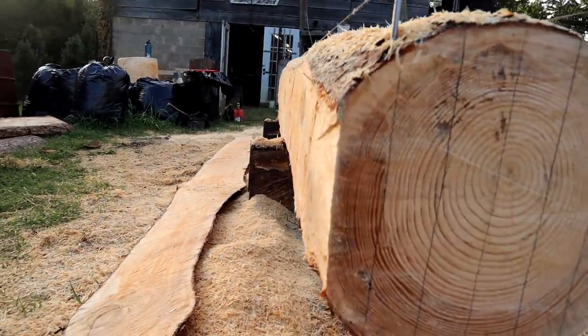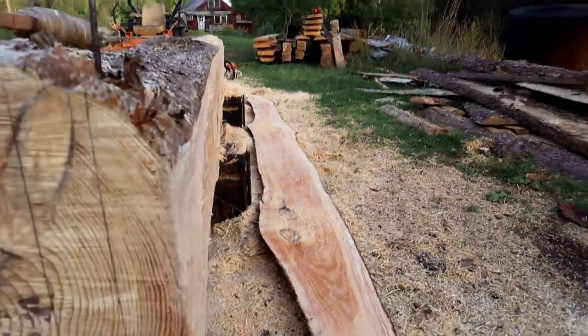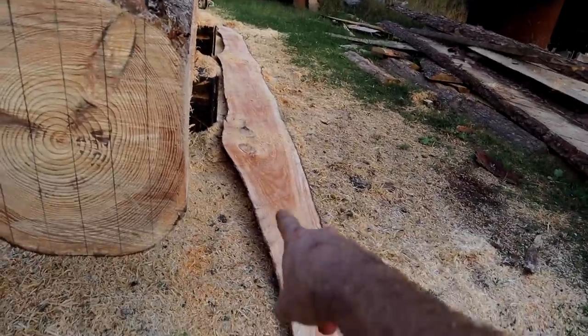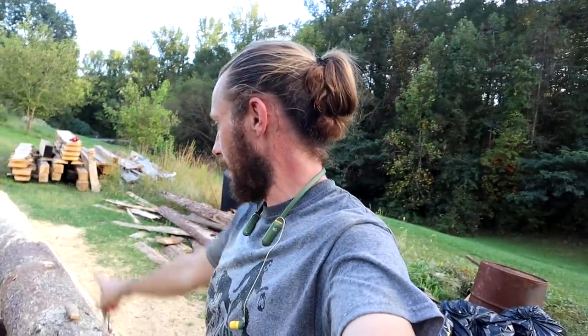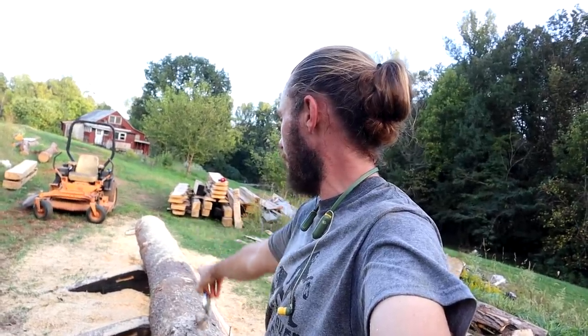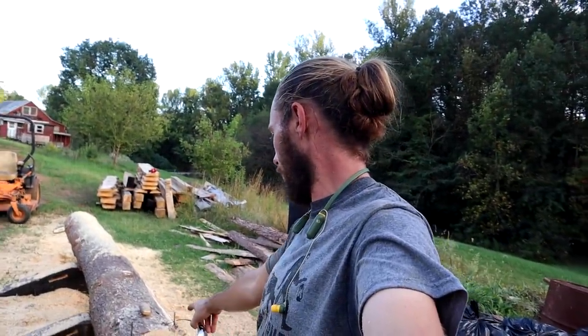There's my first cut — pretty straight. I can already see right here it kind of goes in just a little bit. Those knots are hard to deal with, but it's not too bad. It looks like it only went in maybe a quarter inch. So that piece on the ground is usable, but it's all bark and sap wood, so it's going to warp and turn into a banana. Basically rinse and repeat. This other side — I can already tell there's going to be bark left in the middle, but that's fine. So that means I will get five boards out of this log. As I'm running out of daylight I can smell dinner coming — time to go eat dinner.